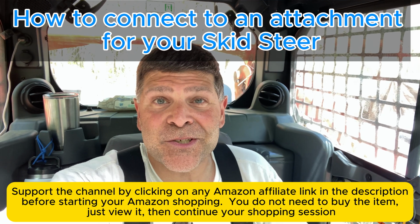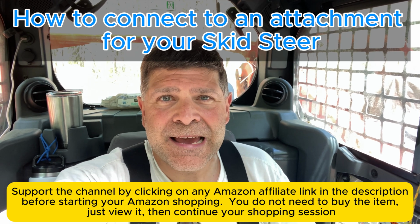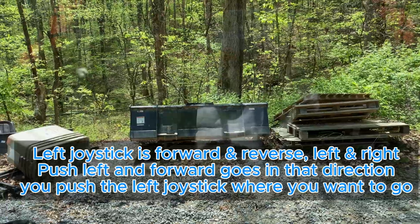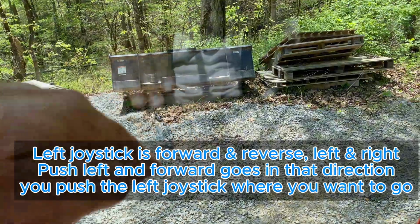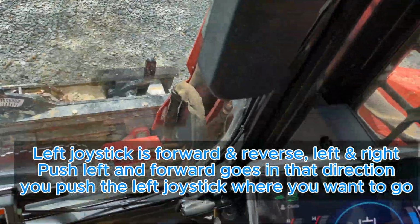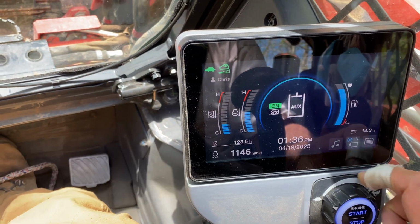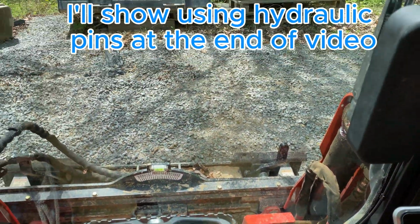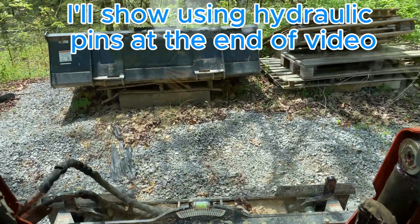Got a request from a subscriber for how do you hook up a bucket. So I'm going to go over real quickly how I connect my bucket onto my machine. So I've got my bucket off there in front of me. I like to keep it up on pallets so it's tilted down a bit so it doesn't collect rainwater and grow mosquitoes. But I usually dial down my throttle to turtle mode, and I'm on turtle mode for speed. So that way all my movements of the machine are very slow as I approach the bucket.